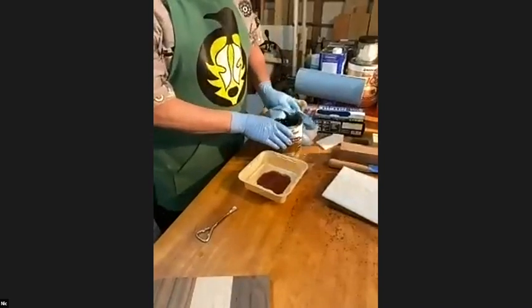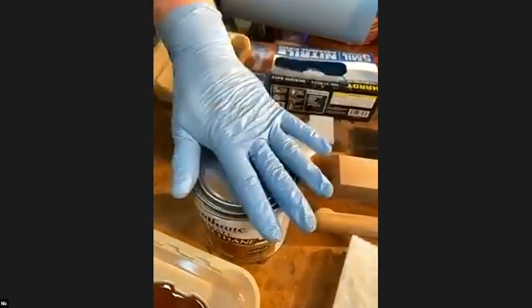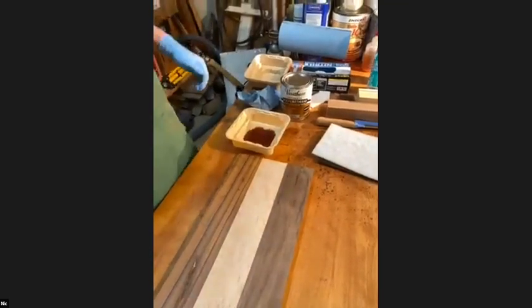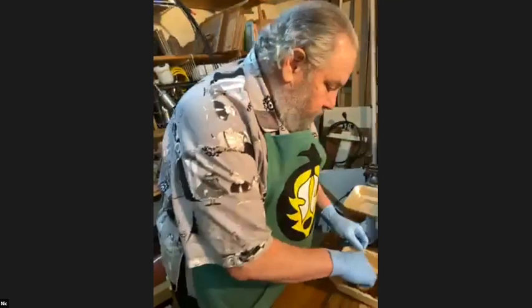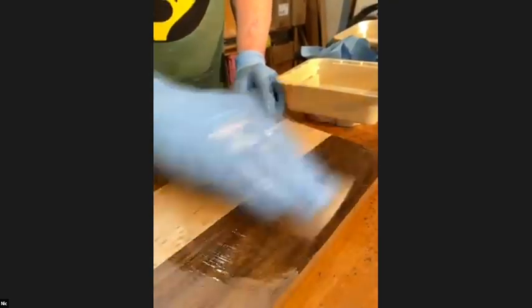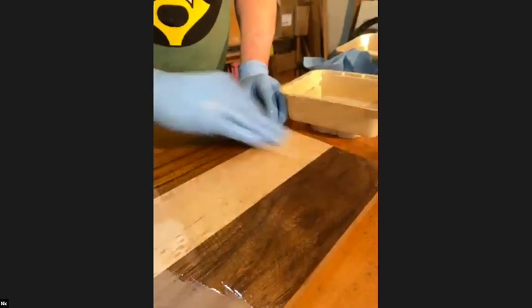The urethane drains right back through those holes, leaving a clean rim I can seal again. My objective is to flood the wood, let it absorb what it needs, then wipe it off. I'm using Scotch-Brite as my preferred applicator. I flood it on — I'd do the end grain too — and with polyurethane it doesn't take as long as with straight oil, so you don't have to wait as long for it to soak in.